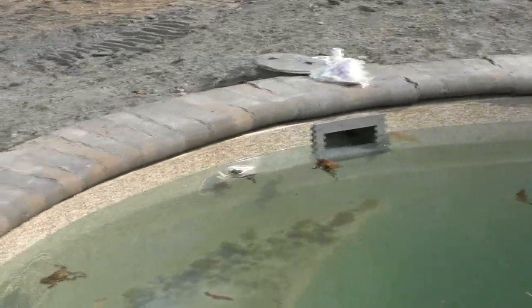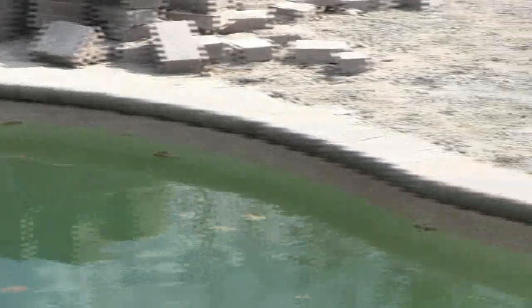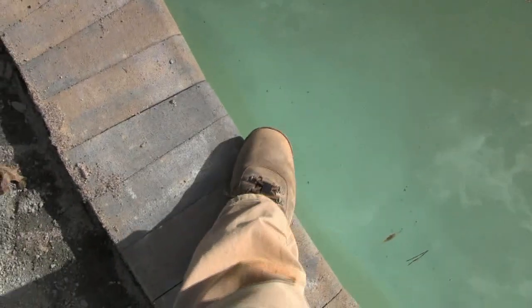It's not sitting on concrete — it's actually sitting on stone dust, which when it becomes wet, moves. And we've got a situation where this coping is going to pop off the pool in very short order. In fact, you can actually see these pavers wobble just by moving my foot on them. That's what we have — it's just not going to work.